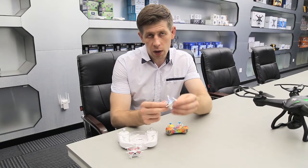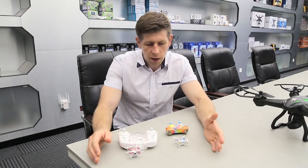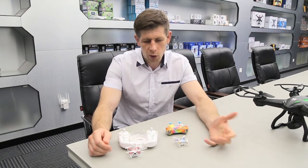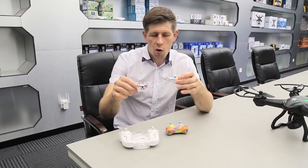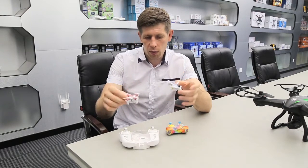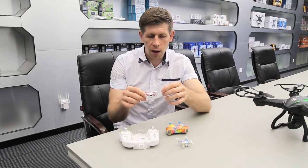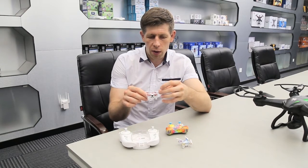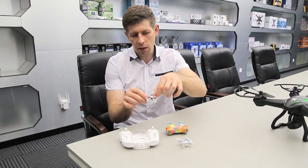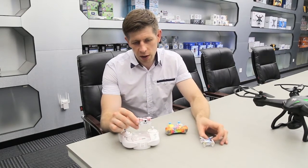There are two types of propeller angles, so be sure they are in the correct places. The second fix is basic gyroscope calibration, which helps solve many problems - especially when the drone does not hover in the same place and drifts right, left, forward, or backwards, or when the motors are trying to spin when you first pair to your drone and want to fly but they feel stuck.